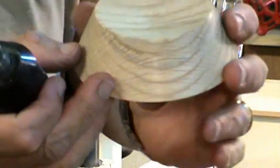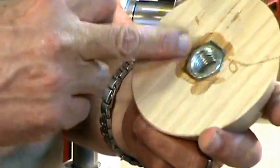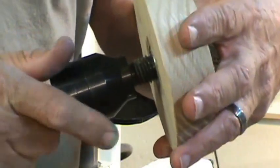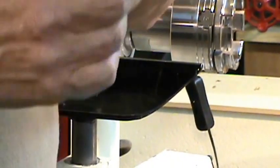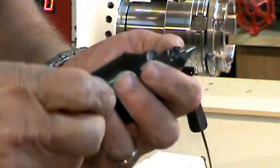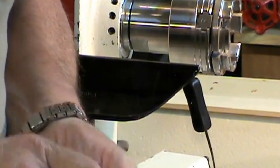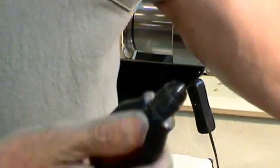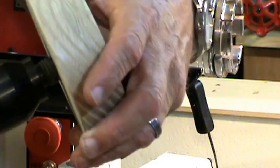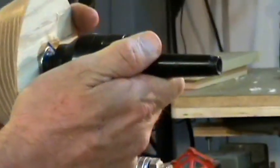Cone accessories are really simple and easy to make — very fast. Take a 3/4ths nut, drill a 1-inch hole, square it out, epoxy the nut in, and now you have a cone to fit on the end of your live center. If you're doing pepper mills, you can make a dedicated cone for your pepper mills and just screw it right on here when you're ready.